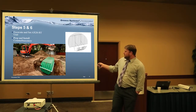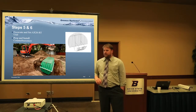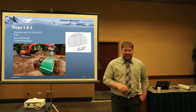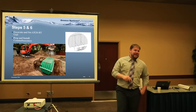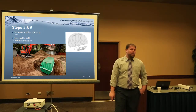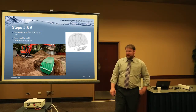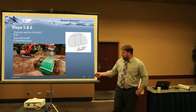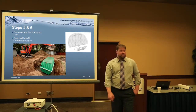When you install, we have counter buoyancy options — you can do this a variety of ways. You can use the upside-down infiltrator pour-concrete method, or pick up a reject C-grade curbing from the precaster for about $20. We also provide a fiberglass flange kit. These units are only filled with water up to about mid-level, so in a high-water area they can become very buoyant. Make sure you have those countermeasures installed if needed.